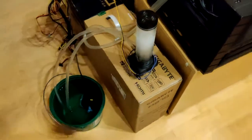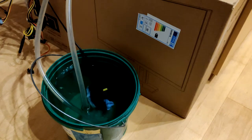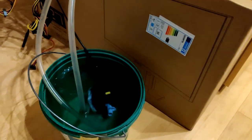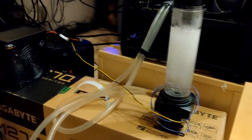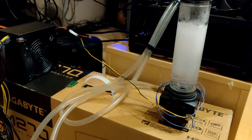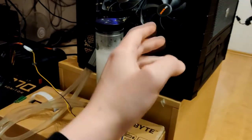but what I've done here is basically, instead of the usual water cooling loop, I now have a bucket filled with water. There's no radiator in this, it's just the tubes. Then there's an aquarium pump in there to just shuffle around the water a bit. Then here's my pump, which is powered externally by this power supply, which there's really no reason to, but it was easier for testing because I don't have to turn on the test bench for that.